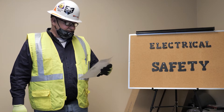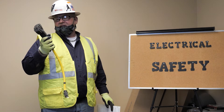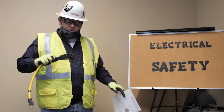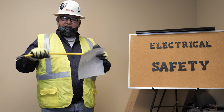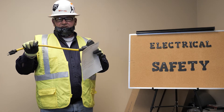This is a GFCI — a ground fault circuit interrupter. What it does is detect slight changes in amperage. When this is plugged in at your power source and your extension cords are plugged from this point on to your tools, anything that is damaged, this GFCI should detect and open up the circuit.